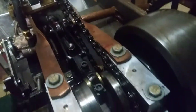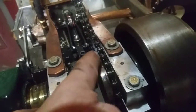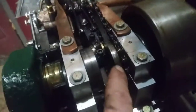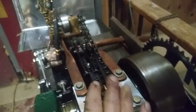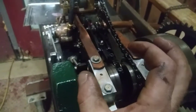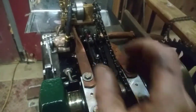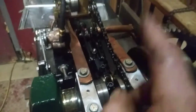I have a governor. I machined on the crank an interference fit to receive this bicycle sprocket. I had to heat the sprocket up so it swelled, slipped it on, and when it cooled it grabbed on to the proper diameter — just a couple thousandths. The machinist handbook talks all about interference fits. Depending on the size of the material you're working with, you'll have to allow a few more thousandths — basically you're machining something oversized, heat the mating part, slip it on, and it shrinks. So that bicycle sprocket has been interference-fit to this crank.